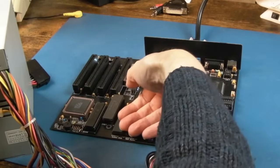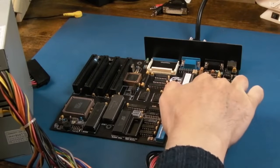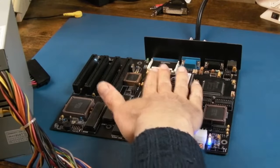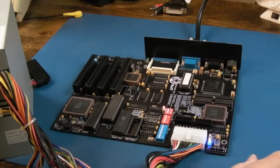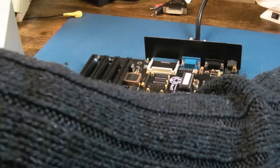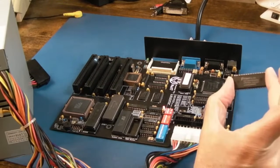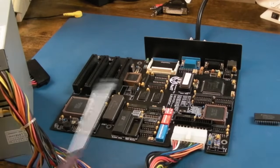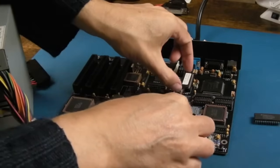But anyway, the way things stand, it's not doing much, is it? Nothing's getting hot here. We've definitely got some sort of fault though, haven't we? The question is, what? The obvious one is the VGA BIOS. Well, you know what? It's a hell of a coincidence, but I just happen to have a Trident VGA BIOS here, if you saw the work I did on the Trident cards. Yeah, it's TVGA 9000.